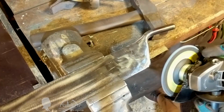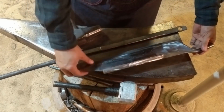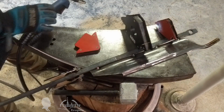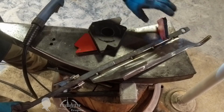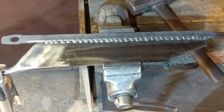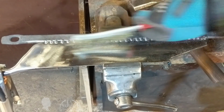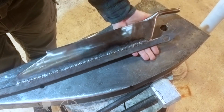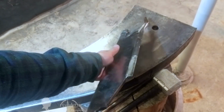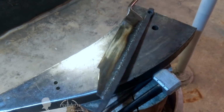Of course, the swivel mount should be given extra attention. After all, this is where the maximum loads will be exerted during the Cloggers knife's operation. Given the length of the lever and my weight, the stresses here may well exceed a ton per square centimeter. Taking into account that the deformation sigma for C45 grade steel is about 5 tons per square centimeter, the maximum design load of this part is only 5 times greater than the experimental one. It is here where the weld seam should be of the highest quality and reliability.